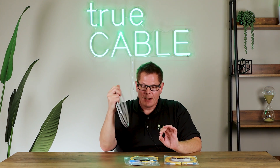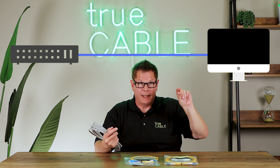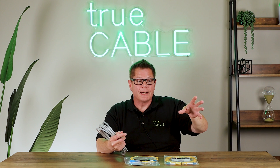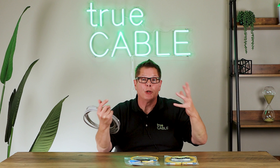When it comes to copper Ethernet, you may be aware that from powered device to powered device, you have a maximum channel length of 328 feet. That is at 68 degrees Fahrenheit, and that includes patch cords as well. There are ways to extend that — you can add a PoE-powered switch in the middle of a channel and re-extend it, and that's perfectly okay to do. But at a certain point it gets a bit unwieldy. What if you need to go 1,200 feet? Sometimes another cable type altogether would do the job better.